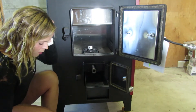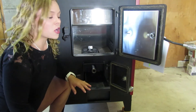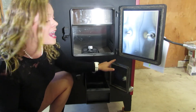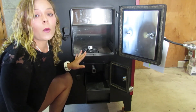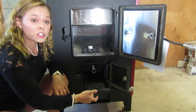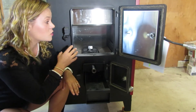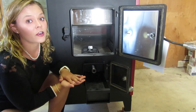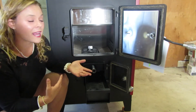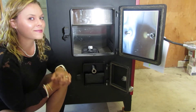One thing I do want to point out is that a lot of people will tend to pull out their ash pan when they're operating the stove, and this is going to be a big no-no on the Fire Chief. This ash pan door is fully gasketed, and that's to keep this thing airtight. This unit will auto adjust and auto draft based on your thermostat set up in your home. If you start pulling out your ash pan or leave your ash pan door open, you can get too much airflow inside the firebox and too hot of a fire. If you do this and warp your firebox, you're not technically under warranty because you're not burning it to the manufacturer's specifications. It's also not required to pull out your ash pan to get the fire started, so just keep that in mind.